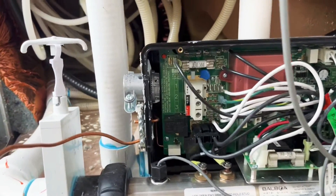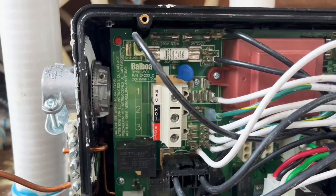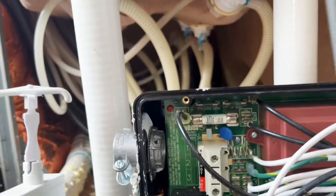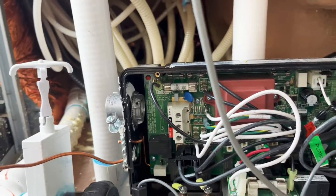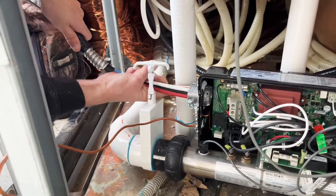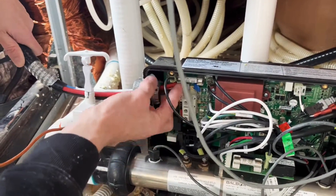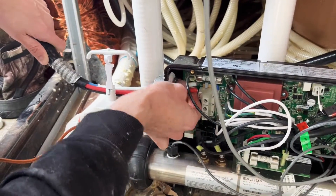Here we have a control board for a hot tub. Very simple labeling — you've got your neutral and your two hots. It's not going to matter which hot goes under which because it's single phase. You can see we've got a bonding lug here to bond this flex connector. Inside of here is a plastic box, and you've got to bring the connector in so that your armor is touching your flex. We don't have to do a tech connector because we're not needing the weather tight.